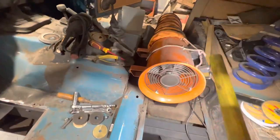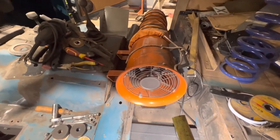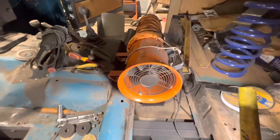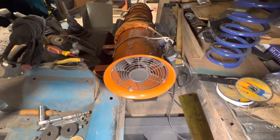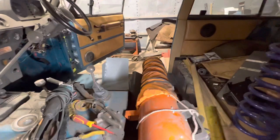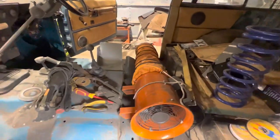Something I wanted to mention to anybody just starting out doing any welding - buy one of these extractors. They're fantastic, not a lot of money on Amazon, and it really helps with angle grinding or welding because it's pulling the air rather than blowing the gas out when you're trying to weld. A fan would blow your gas away, but an extractor won't affect your welding. When you look at what's come out of it - you can see the color of the fans in there - that would all have been in your lungs. The back of the hose is just full of particles of general crap you really don't want to be breathing in.